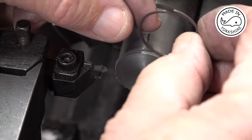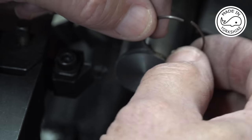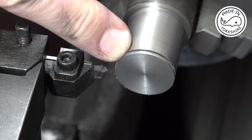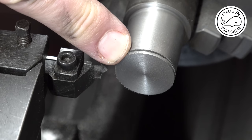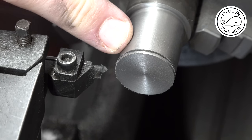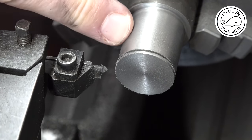One of the rings. Oh yeah, fits in there okay. You're happy with that? So what I need to do is to move the tool down again, create a gap of 50 thou and do another cut exactly the same, and then I move it down again by another measurement, I haven't worked that out yet, and cut another groove. But I'll do those two off camera.